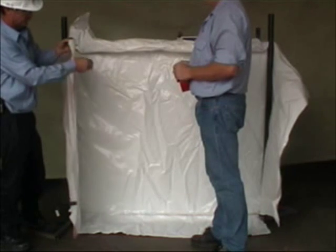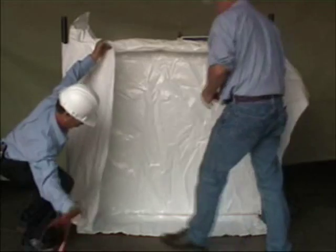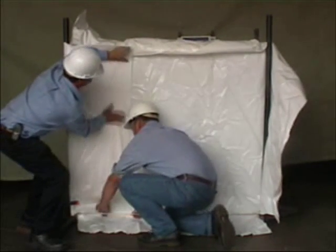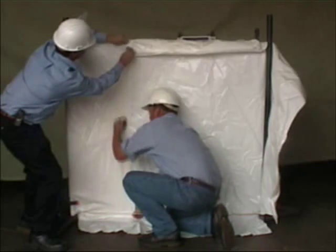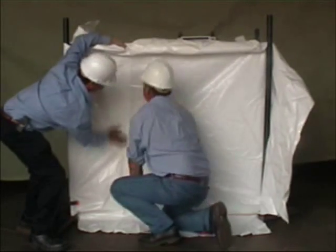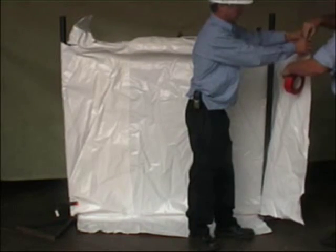Once the plastic has been trimmed to cover the desired area, the use of splicing tape is a very simple way of holding the plastic in position, ready for it to be welded. It is recommended that at least 700 mm or thereabouts is used as an overlap to give a very strong welded surface.